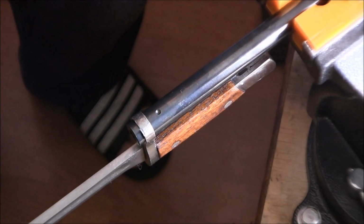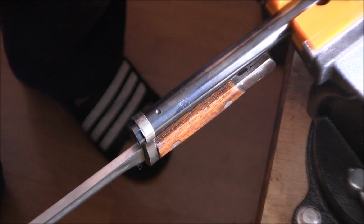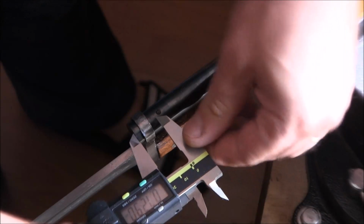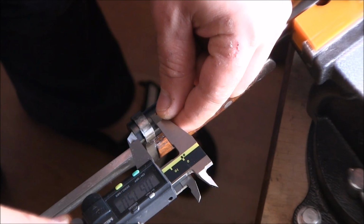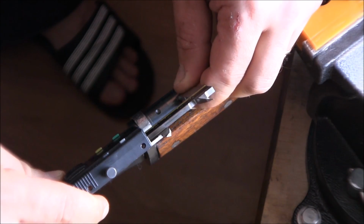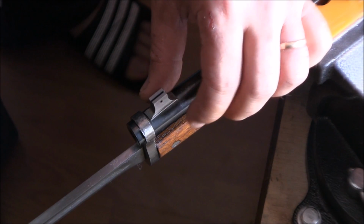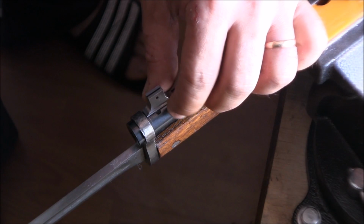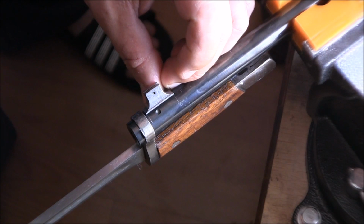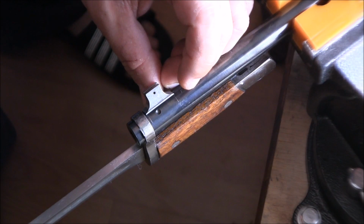The reason why I have my bayonet placed on the muzzle is because I know this is where it basically sits. So what I'm going to want to do is start marking slightly away from the bayonet. And if I lay my base on top of these two, I can verify whether or not I marked everything correctly. So, yeah, as long as I stay within the lines when I'm filing, I think we're going to be okay.